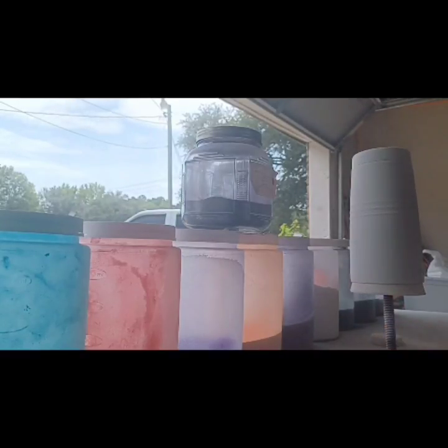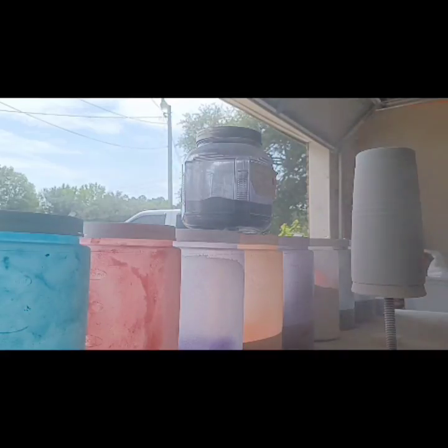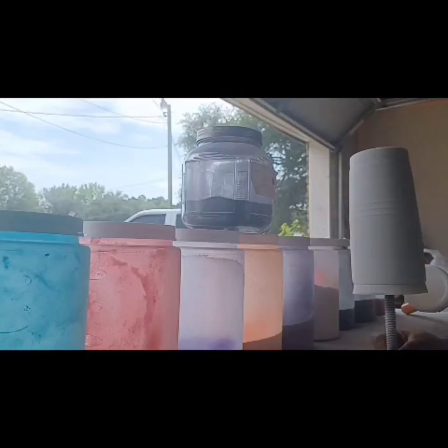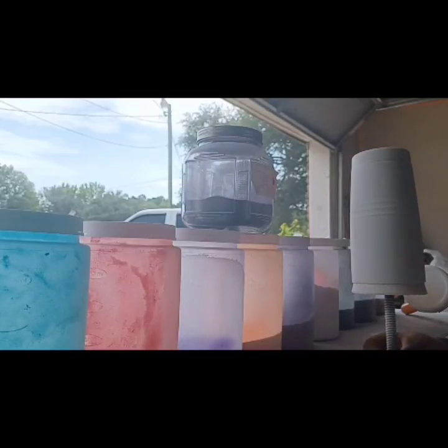And then as you do it, you want to look for any spots you've missed. Any dark spots where you can still see the stainless steel underneath. Because then once you cure it, it's going to show through. We're eventually going to buy a better gun, but for now this will work. Alright. Another inspection. Alright, looks coated to me, so we're going to go ahead and put it in the oven.